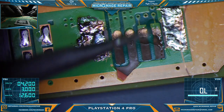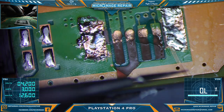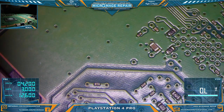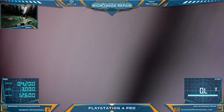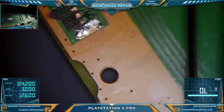We'll loop it around, secure it down, and then we might even be able to get a solder blob in the loop. That will be our approach, I think. All right, snap off a bit to use. I'm gonna want my tweezers and these 3D ones for that. And now we're gonna grab our Pico pencil and tin those pads, and then we'll run the wire.